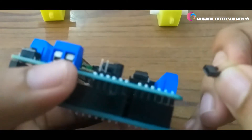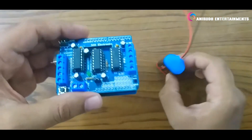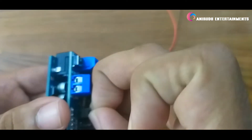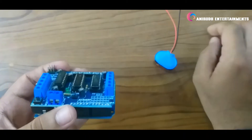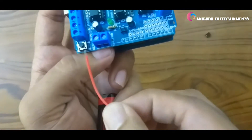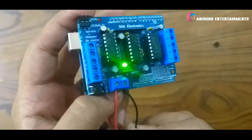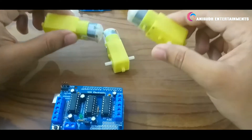We're using a nine-volt battery to power our shield, so just remove the jumper. I'm touching the wires to the terminal — positive here. You can see the LED turns on, confirming our shield is powered.